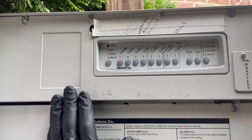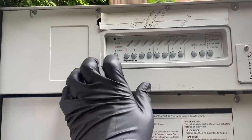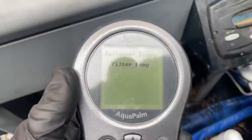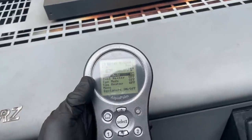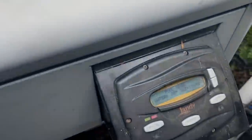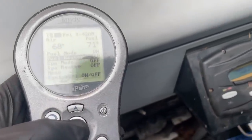It has interlock. It's in service mode right now — interesting. So let's go spa, water filter — it should come on. I went to the AquaLink control and switched from service to auto. Let's go to pool heater, set it to on, 88 degrees. Good. Select — now it should get a signal to fire up.